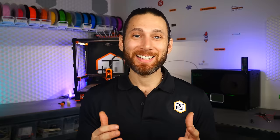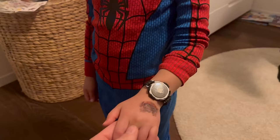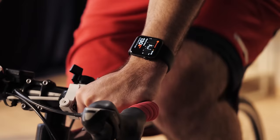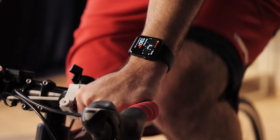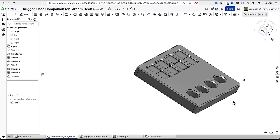I definitely want to use this stuff way more often. Chinchilla filament is ideal for creating objects that require a soft, flexible touch such as grips, gaskets, wearable items, and flexible hinges. If you've ever worked with TPU and found that it is flexible but doesn't feel that good on your skin, Chinchilla is the material you've been looking for. Its ability to absorb impacts and resist abrasion makes it suitable for protective gear and parts subject to frequent handling or movement. Because of its safety rating for skin contact, mixed with that pleasant almost peach-skin fuzzy finish, I'd recommend it for handlebars, tool grips, or anything that is going to be touched a lot. Personally, I'm going to use it to make a foam-like cutout for my Streamdeck rugged case to protect the buttons and dials — though considering the price, I might just cut it out of foam.